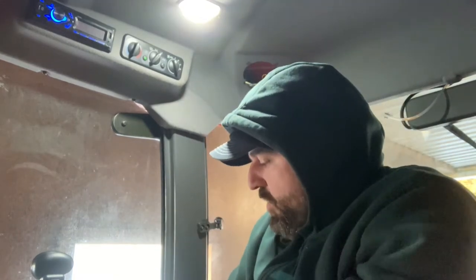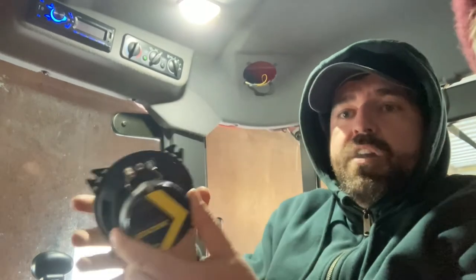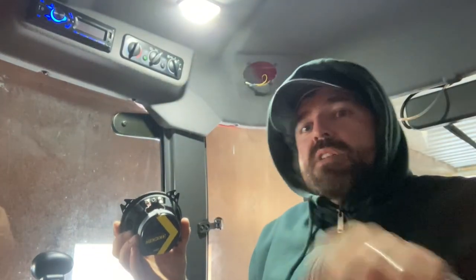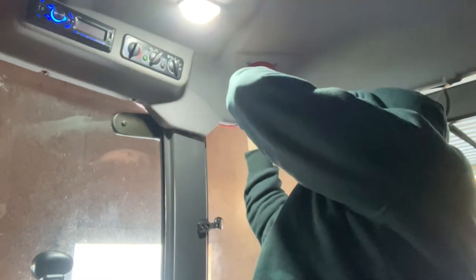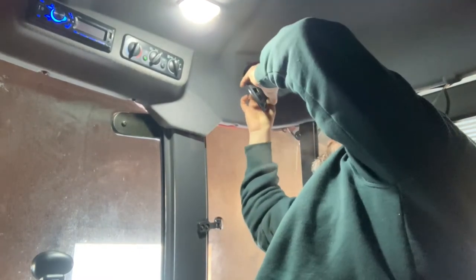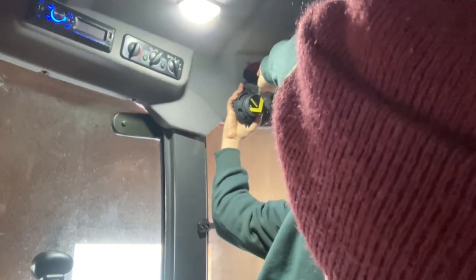So, when you take the bezel off, there's four mounting screw spots. So, we have the Kicker speaker. On the Kicker speaker is two blade type adapters, one small, one large. Can you step out of the film for a second, buddy? Yeah. So we have a harness in here. It's pretty straightforward. It's universal. A small one goes on the small one, as you would figure. Well, it's gonna get my frozen fingers just being stiff. And then, large on large.